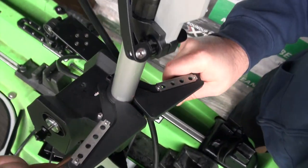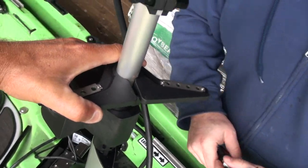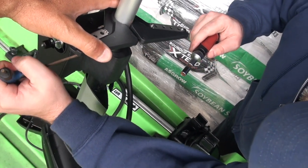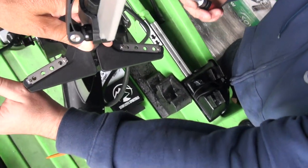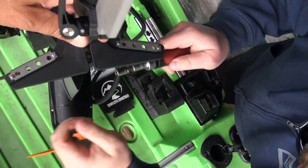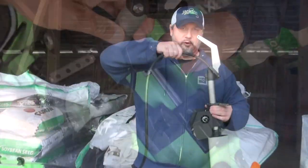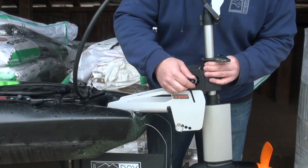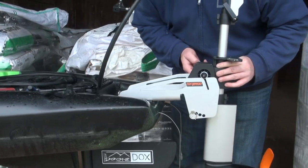So let's look down and make sure that's straight before you go all the way. We're going to kick that out and loosen it a little bit. You may want to pull it down and kind of get it between your legs, and if you look down on it, you're actually not that far off, but I would push this side that way. We're going to get it in place and see where we're at as far as meeting where the water line is on our propeller. See if we're low enough, or too high, or where we're at with everything.